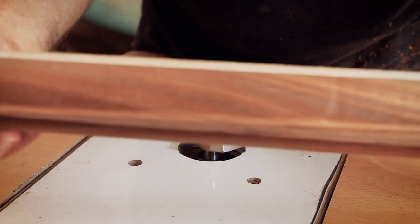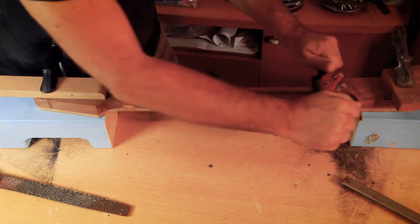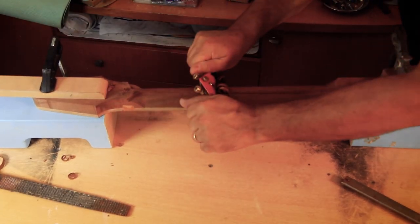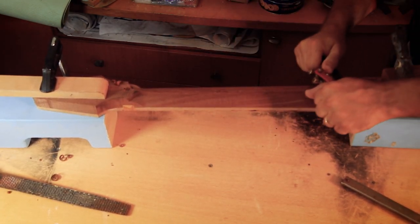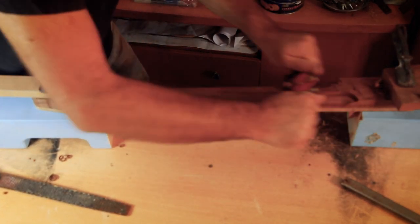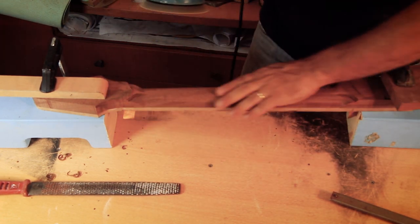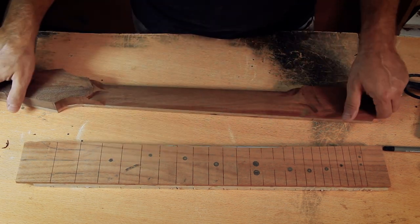The routing leaves a ridge running along the back — it's narrower on the headstock side and about 13 millimeters wider towards the heel. I find the spokeshave the ideal tool to remove it, but any small plane, scraper, or file can do the work as well. I'll be careful with rasps here as the round areas are already fairly smooth and we don't want to damage them. When the bulk of the material is removed, I give it some light sanding with 100-grit paper, and that's pretty much done.